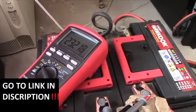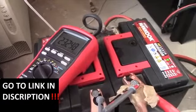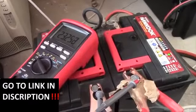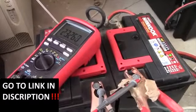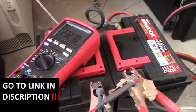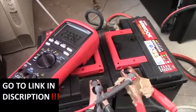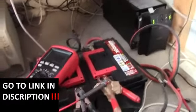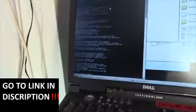Voltage is going right back up. I'm not entirely sure why this happens, but pretty much all lead-acid batteries that are left to lie for a while will do this. You can essentially get over a volt back, and the voltage can keep going up for half an hour really, depending on the load. So I'm going to let this thing run, powering my 500W work lamp, and we'll see what battery state we get when it's done.